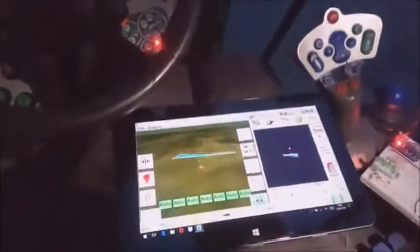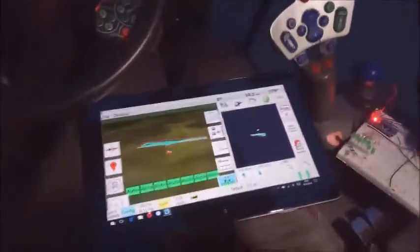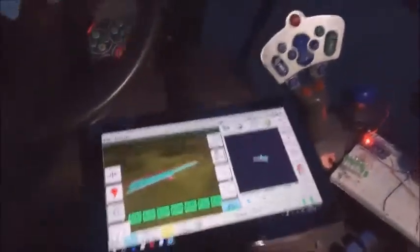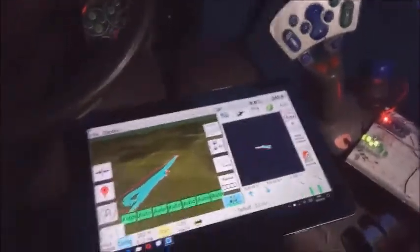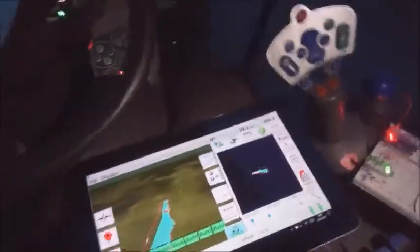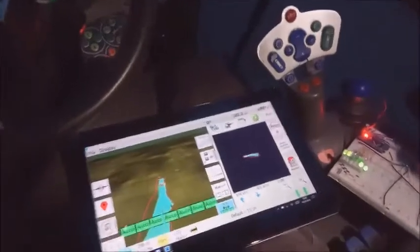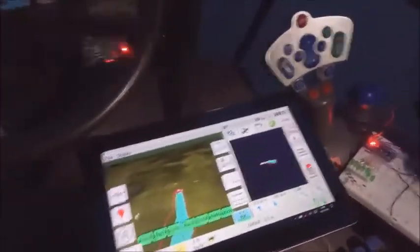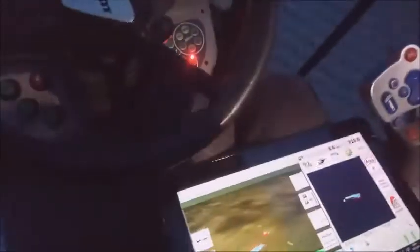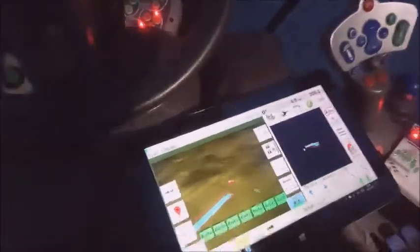So it works pretty quick, and there's no problem with the Bluetooth — both the GPS and the section control connected via Bluetooth. It reacts fast enough and the tablet has enough horsepower to handle all seven sections. Some sections turn on and some don't when driving on the other side. Crossing the border and everything is off. Works pretty good, even at a higher speed.